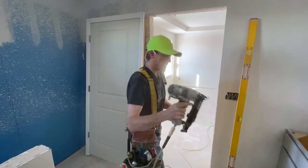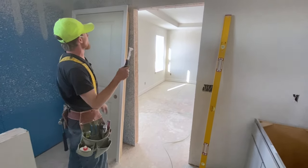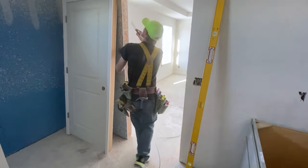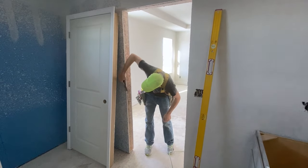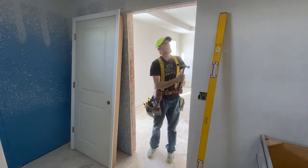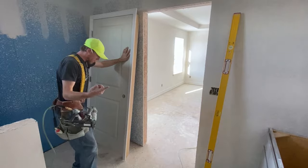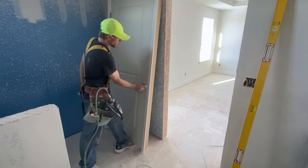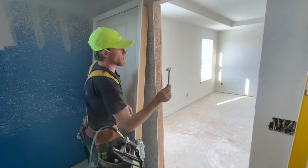Switched guns — we're going to use two-inch nails with the two-and-a-half-inch Metabo finish nailer. I need to get out a scraper. I've got a couple chunks in the opening and I just want to make sure it's all cleaned out. Scrape that off to the side, make sure all the chunks are off. If you maybe just ripped out your old door and there's a shim and a couple nails in there, make sure we're hammering everything in and getting that cleared up. Now it's just getting the door into the hole. What I want to do is put my foot underneath.